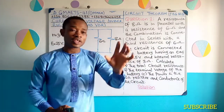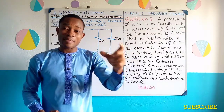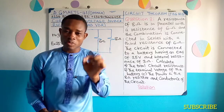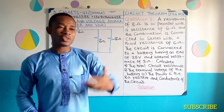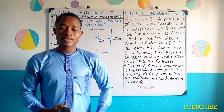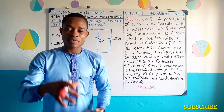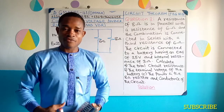You can think about this: if you have a battery — usually a bullet battery — you have the EMF to be 1.5 volts. But if you measure that EMF, you will discover that your voltmeter won't read that 1.5 exactly. Usually it will be reading something like 1.49, 1.48 or thereabouts. So what is responsible for the loss in the actual EMF of the battery? It's the internal resistance of the cell.